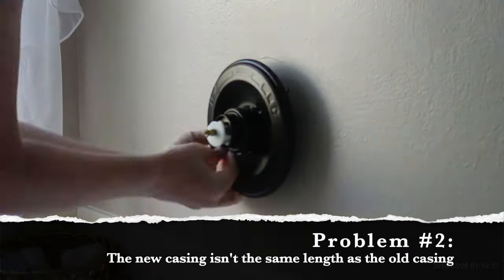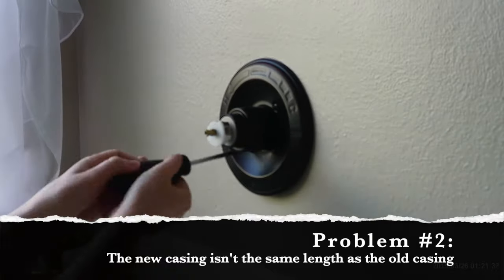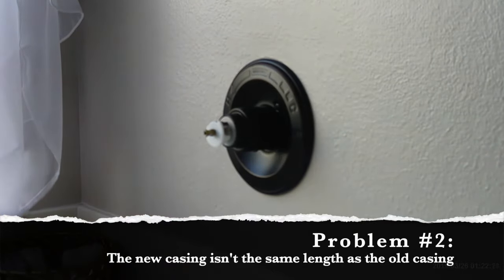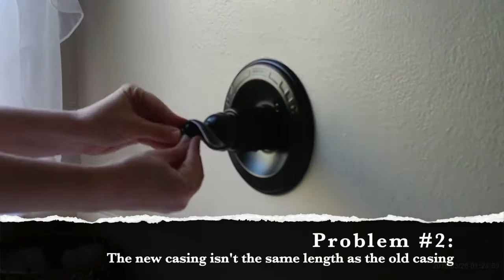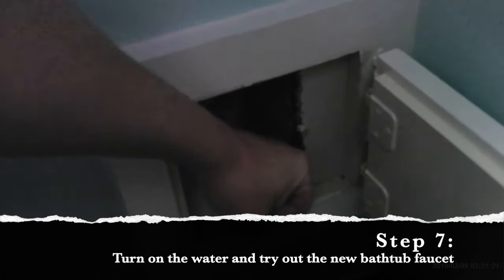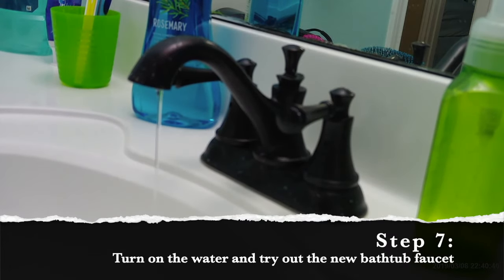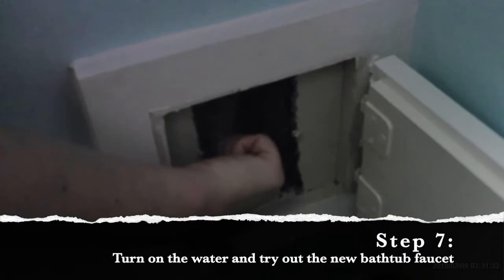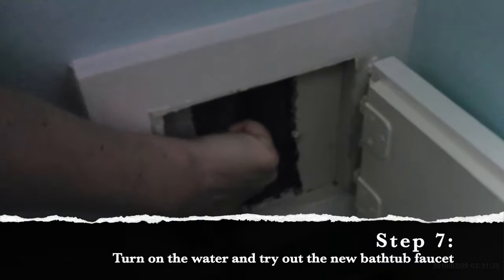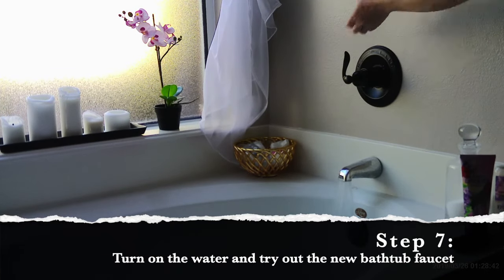After the casing was all dry I started installing the faucet again. I was really happy with how it turned out — it was almost a perfect match between the product itself and my spray paint job. And that's it! All that's left is to turn the water back on. Two things to keep in mind: make sure you have an open faucet running somewhere in your house, and turn the water back on somewhat slowly. If you turn it on too fast there's a potential it could cause damage to your pipes. Go slow and try out your new bathtub faucet.